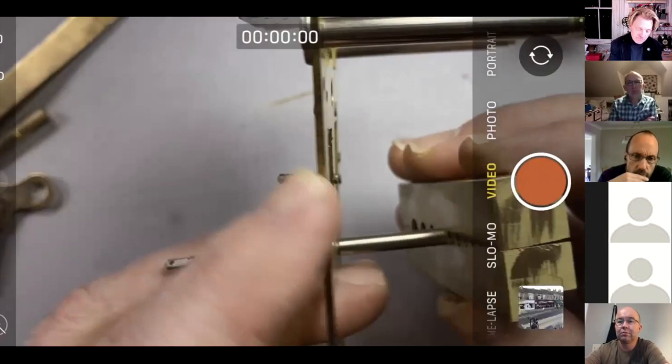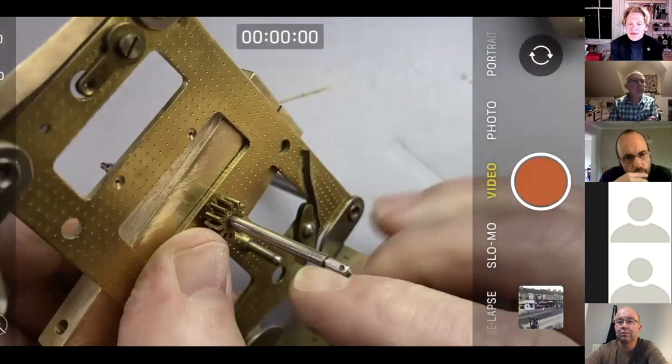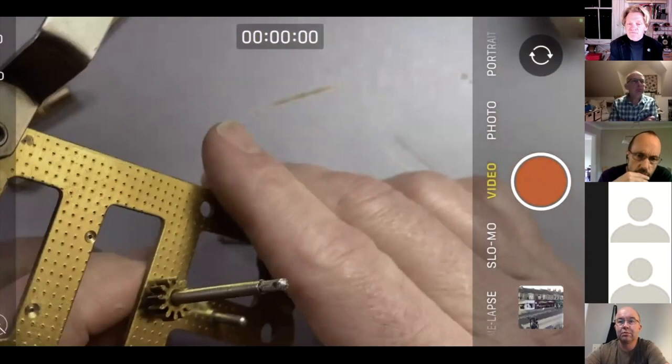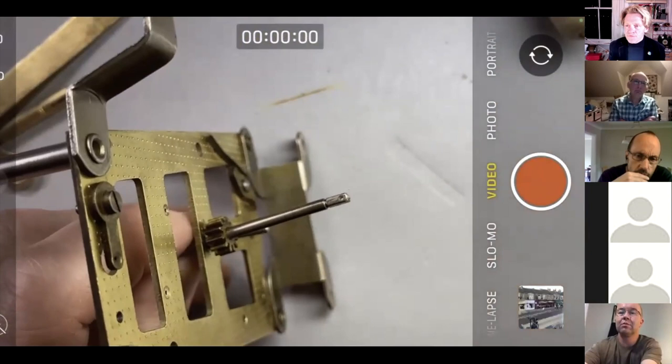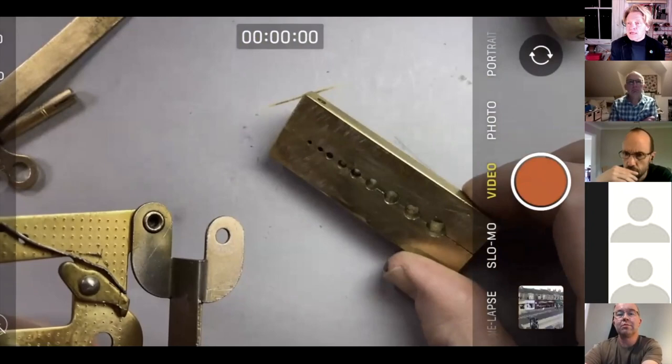So we're going to use this on the inside of the plate. You can actually find the one that the hole fits in, like that, to support the plate when we hit down on this end. Now, we can't hit on here with our hammer because it's going to damage it. So what we need to do is to find some way of protecting that square. So we measure the across flat size of that square. I know in this case, it's just about 2 millimeters. This thing is called a split stake, brass split stake. So this is 2 millimeters across flats.